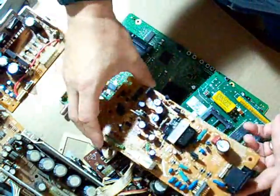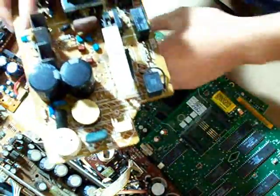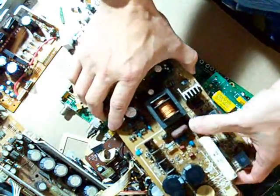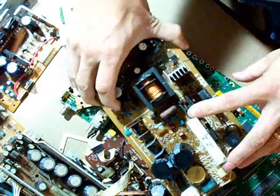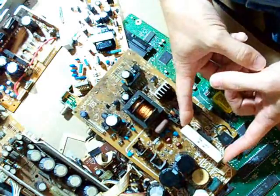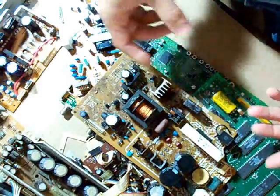What I will do is take some of the parts off of these and reuse them. Here are some nice resistors — 20 watts. Got some more boards with nice resistors on them. This is good for measuring the load. What you do is put your voltage across it, measure what voltage you are actually getting, take the ohms off of the resistor, and calculate the amperage.